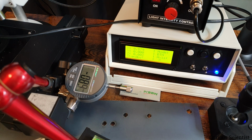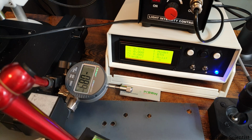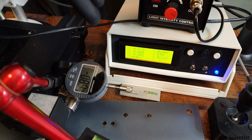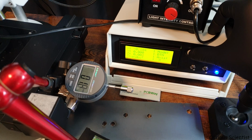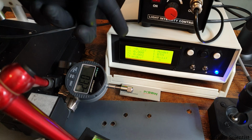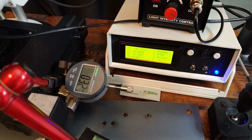So it's moving as it should. And now I see the negative number here. I was wrong, because we are always moving on the negative scale. So actually that 0.02 was correct, or 0.2 on both sides. It was kind of something like this. But you can see, because when this turns positive, then that's negative. So I was wrong, but the system was correct.